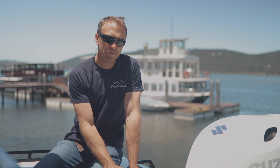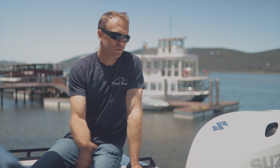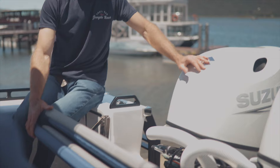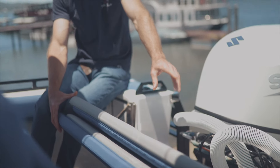This boat is designed for surf launches and safety is always an issue. The biggest problem is when you get water in the boat, it fills up and the water can't get out. With a closed transom and a transom door, water goes out one side of the door, the other side gets heavier, the boat flips on its side and you're swamped. The solution is an open transom, which is what we've got — if you do get water onto the boat it can all leave through the back. We have big scuppers but scuppers are never big enough to drain water quickly enough when a big wave comes over the boat.